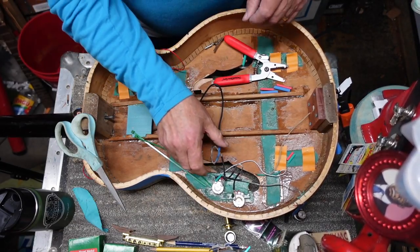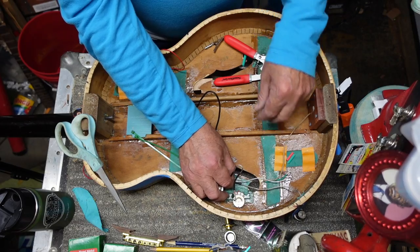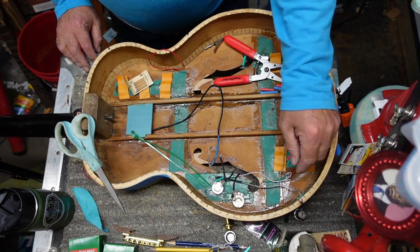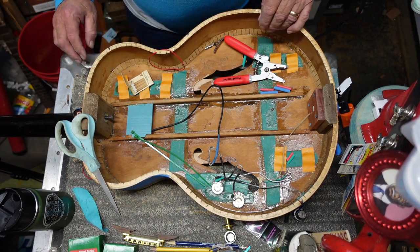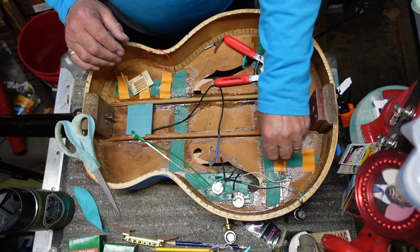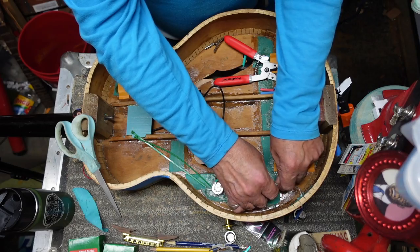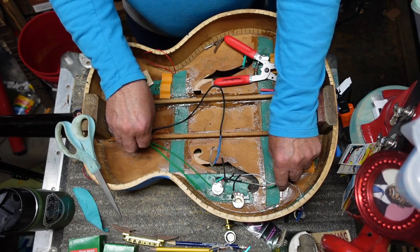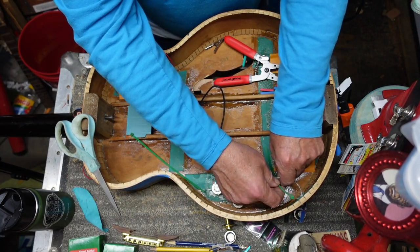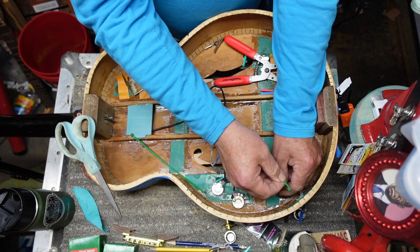Okay, guys, last thing here. These wires are all a little too long. I've got the one going over to the input jack. We're going to leave that one alone because that piece of plating has to come in for the surround. But now that I've got all these together, of course, I've tested them with the trusty screwdriver, but I've wadded those up in a little loom there. And I'm going to use one of these little miniature cable ties, and I'm going to keep this all together.